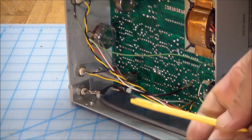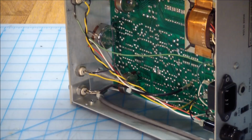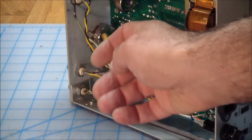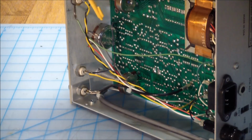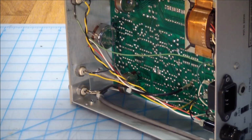because a bunch of these pots are dirty on my instruments, and the sealed aspect of them works against you at this point because you can't spray them down. There are no open slots here. You cannot remove this back plate, even though I played with some of the tabs, bending the tabs back, but they're still crimped onto the main body. You cannot remove them. And so what happens is the dirt's in, and you can't get it out.